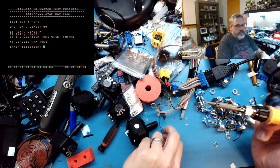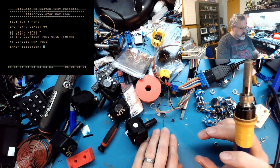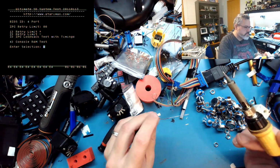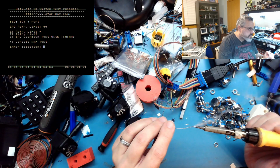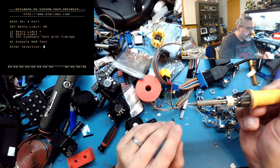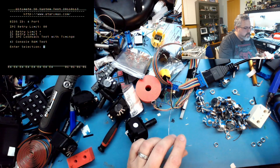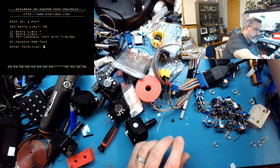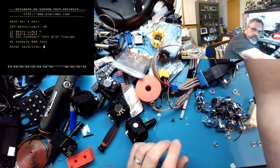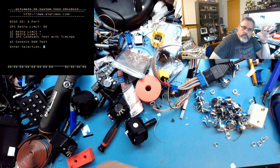So like I said earlier, if you want your soldering iron tips to last a while, what you do is before you turn it off, you purposely load it up with a little extra. See how it's smoking there and it's silver on the tip? That just puts some extra solder on there. So I'm going to specifically turn off the iron with extra solder on the tip, helps protect it.